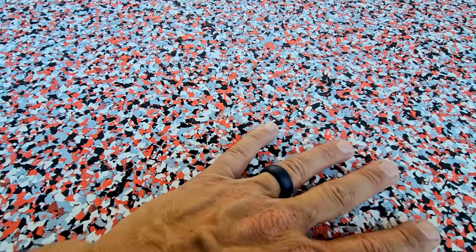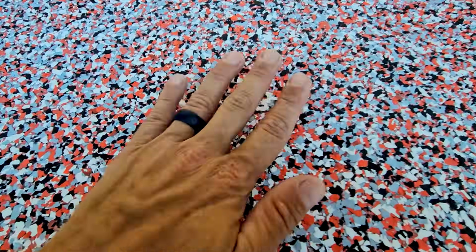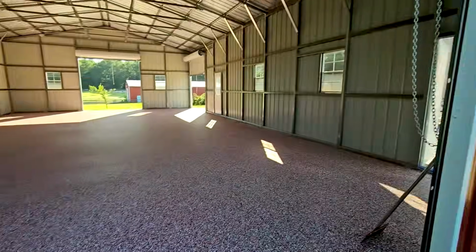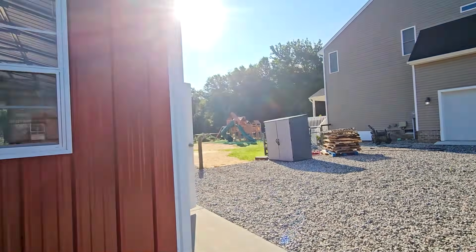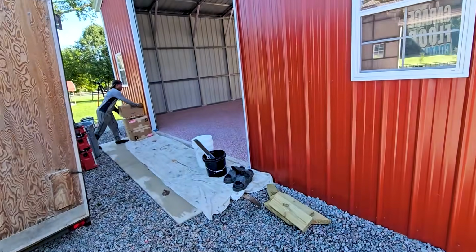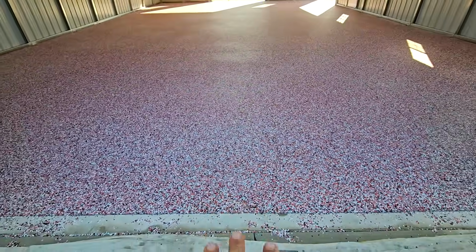But today when we came to do the top coat, it is still a little too damp in the front of the apron here. So you can lift it up. I can still feel water on my hand. So if we were to scrape and put the top coat on top of that, we would encapsulate moisture and it would be premature to failure. You get like algae in there. It would just be gross. So of course, I don't have full sun here. So we're gonna have to go seal coat some driveways. I can't do anything at this point right now. I gotta wait for the sun. Hopefully, where are we at? It's 8:30. It's gotta make its way somewhere over yonder to start drying up here. So that's what happens when you don't do the correct preparation to do the door.